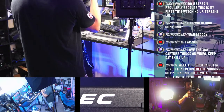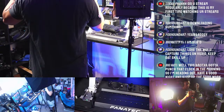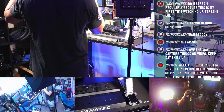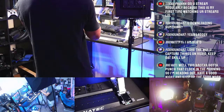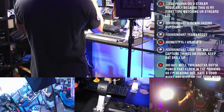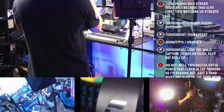And not all manufacturers have the same kind of grounding strategy, I found out. Some manufacturers of hardware try to just make sure that their hardware doesn't produce any EMI. Others try to make sure they don't produce any EMI and respond well to other EMI, so they shield theirs very well, but you can't guarantee that any given product isn't going to interfere with another.